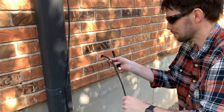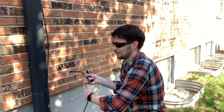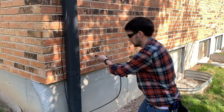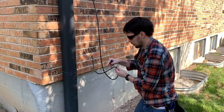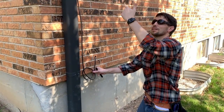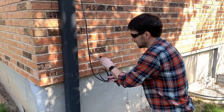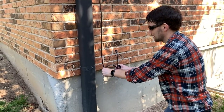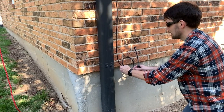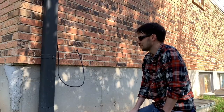We got the cable in. I'm going to feed in all 70 to 80 feet — however long this is. I'm also going to put a drip loop down here. The drip loop is so that when rain comes in, it doesn't drip down the cable straight into your house — even if you have a good caulk job or grommet, some water could leak in. With a drip loop, any water that hits the cable runs down to the bottom. I'll secure the drip loop up here with another screw and caulk up the hole.